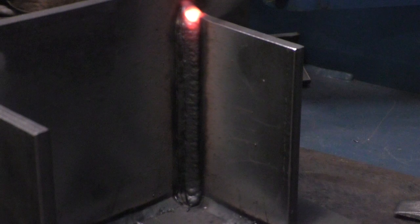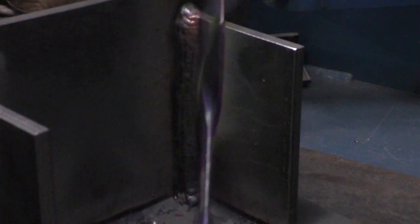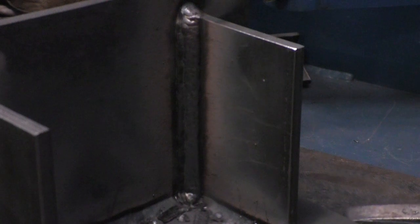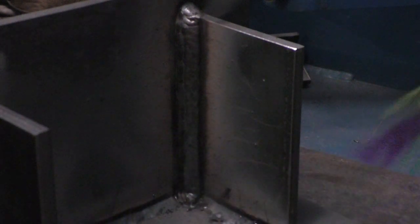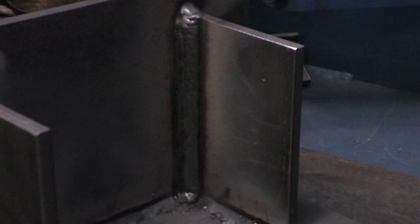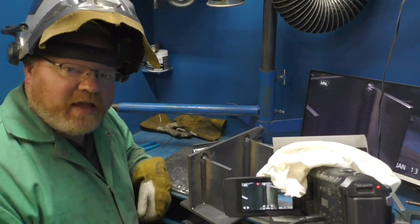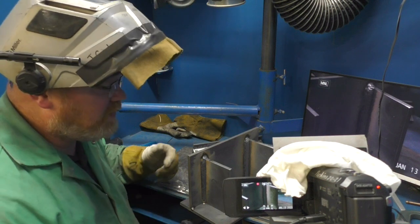I managed to catch my hand on the bottom of the plate — just part of the course today. Here's my multi-pass weld demonstrating the next step. The important thing is that I'm actually welding to the very, very bottom — that's the key point. When I turn this, the other side will be easier to access. I'm going to go ahead and make the back side double-passed off camera and we'll come back to look at tying in the final weld.